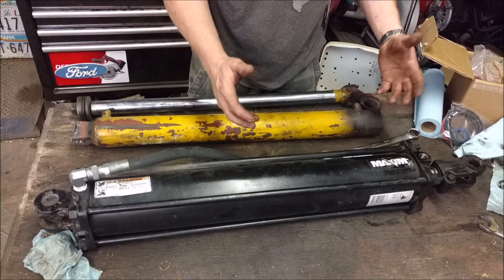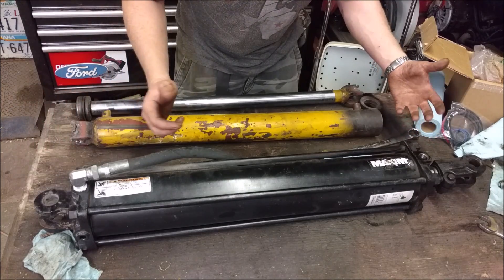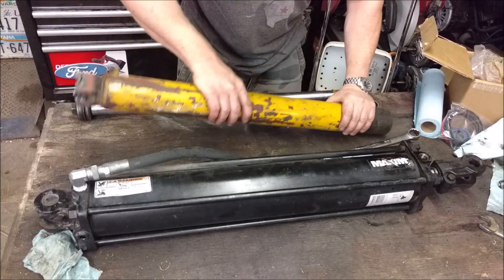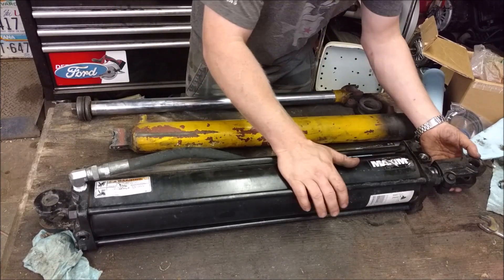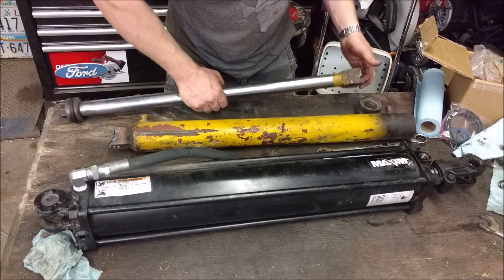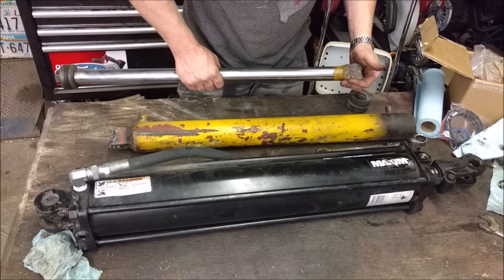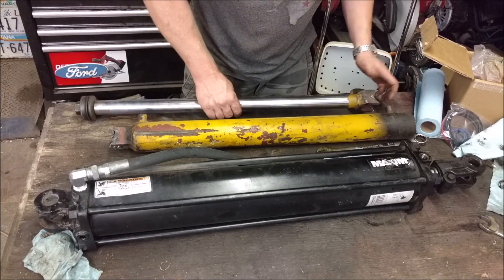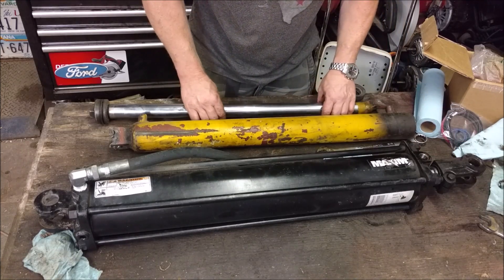A little bit of a difference. The easiest thing about tie rod cylinders is you just take off bolts and it just comes apart. With welded cylinders, things like the clevises on the end you can't take off, you can't interchange. Whereas on a lot of these, like this one, the clevis just screws off — you can put different clevises on. This other one actually got messed up and I had to cut the clevises off and weld it onto one of these cylinders to make it work for my application.